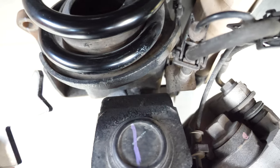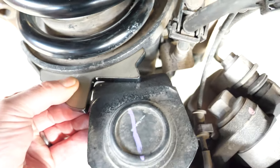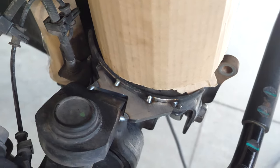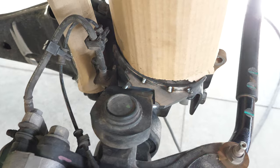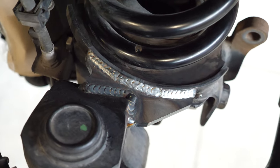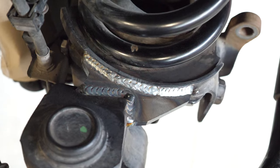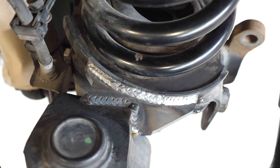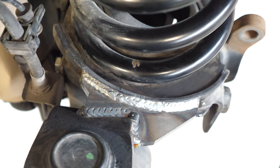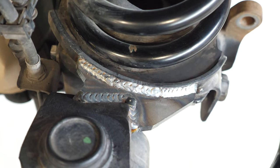Ready for the upper C gussets — they're just going to sit about like that, ready to weld. Be ready to yank that cardboard just in case. There are the upper C gussets — we tacked in both sides and then split it up, doing about an inch and a half on one side then going to the other. Use a little air to cool that rubber isolator because it will start to smoke a little. Be ready with a wet rag — something to keep it cool if it gets really hot.